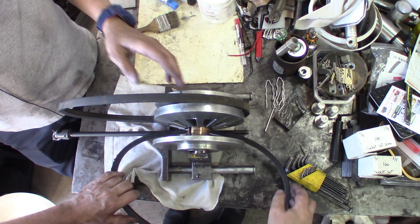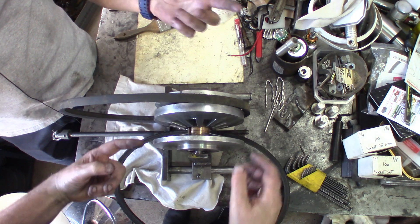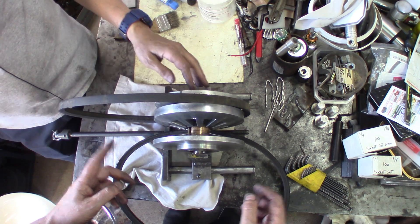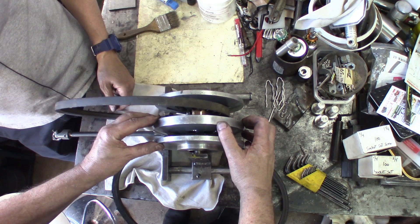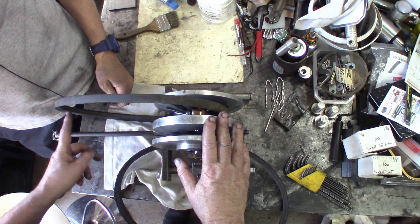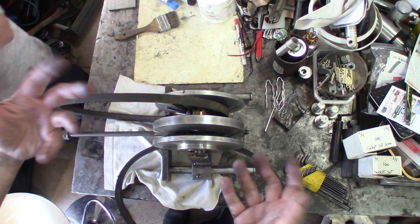What I found unusual with this is that we're used to seeing — like in Bridgeports and all that — pulleys on two shafts. Here you have the pulley on a single shaft, which is what makes this a little bit unusual. You've got a shaft on each end, allowing for fixed points on the ends while still being variable. You've got only one set of pulleys — you don't have the variable pulley and the slave follow-up pulley on the other side, which is the Bridgeport principle, or snowmobiles.